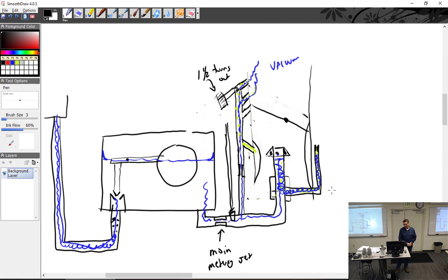Now, while I'm talking about this, and I'm sure this would be a test question, it's certainly an oral question. In the carburetor, the sleeve actually sits vertically, with the hole in it. Then you drop in the rod that turns this way. That rod is on a speedometer cable, a flexible shaft, and a lot of times when mechanics put these together, it ends up misaligned. And then you pull the mixture, and it's kind of over here, over here, over here.